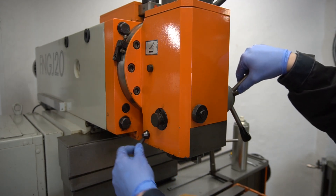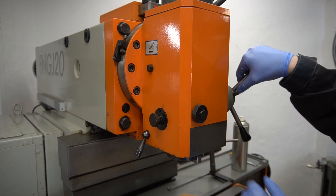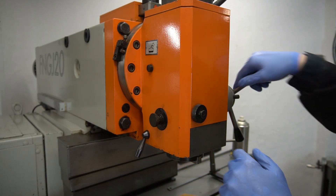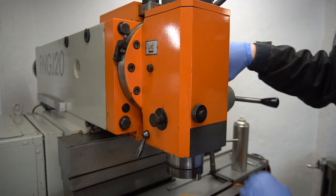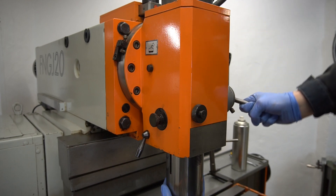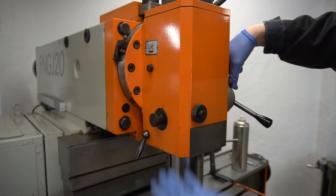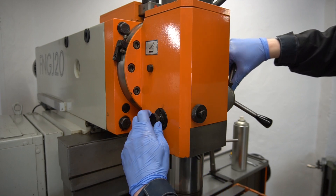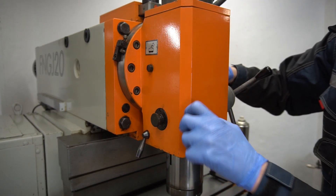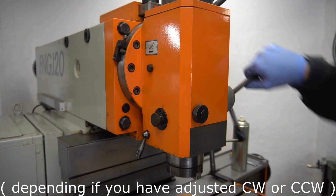So what I want to do is make sure the quill lock is loose, remove the quill key, and tighten the quill handle lock so it won't spin — but loose enough that I can still spin it around. Then I will turn the handle until it's getting loose, turn a little bit more, and then pull it back together again. Push it up, make sure the key is in the keyway, loosen the quill lock all the way, make sure it's free. And then you have either tightened or loosened the spring.